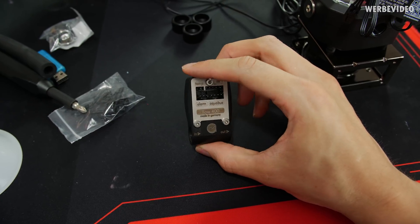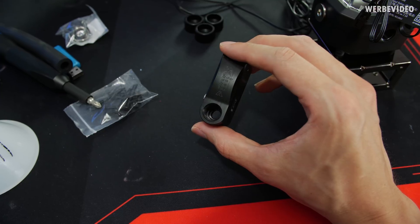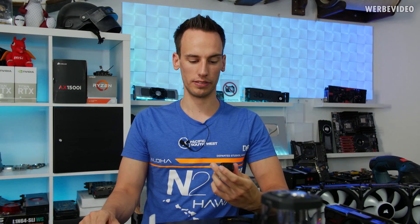This is another MPS flow sensor, the Flow 400, rated for higher flow rates. Looking inside, you cannot see any wheels or fans, but in the center the diameter is slightly smaller. The way these sensors work is quite smart: the center has a smaller diameter — an aperture — which restricts the flow slightly. This restriction causes a pressure difference before and after that point, and by calculating that pressure difference you can easily calculate the flow rate. It uses no mechanical components.